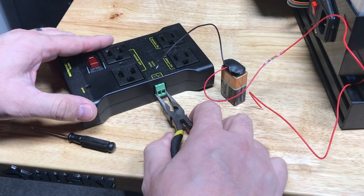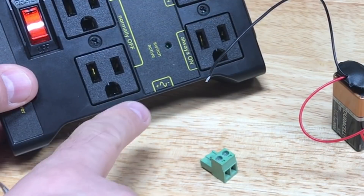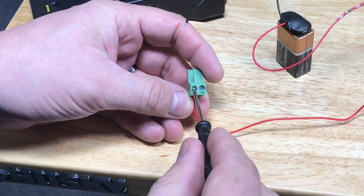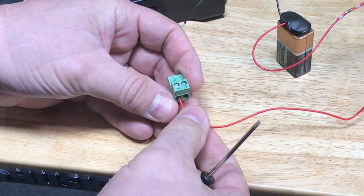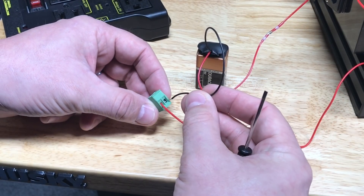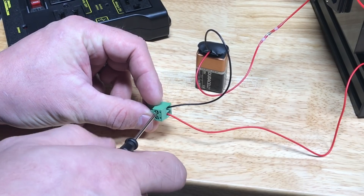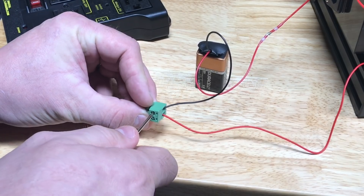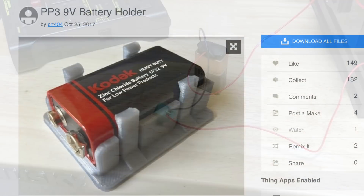Now I need to finish the circuit by connecting to the little connector that pops out of the power relay. The left side is positive, the right side is negative. I'll put the positive on the left side and tighten up that screw, then do the negative side to complete the circuit. I'll take the negative side from the battery clip, put that in the connector, and tighten that screw. Some people like to put a ferrule on these, but I'm just using bare wire — it's low current, it'll work fine. Then you just plug this into the power relay.